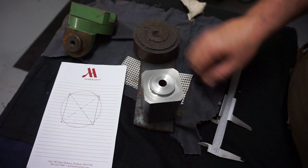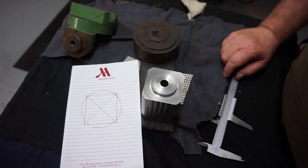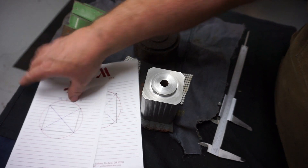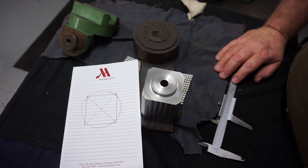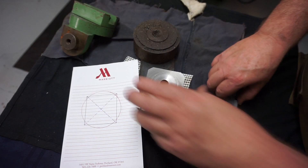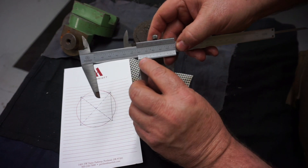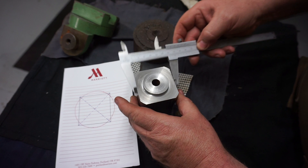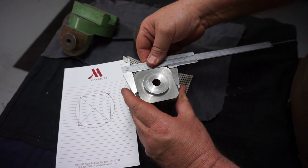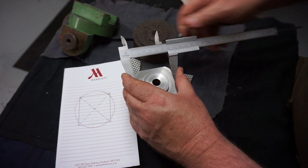I've just finished up the block in the milling machine and I'm quite happy with it. I had to redo my drawing — I'd actually stuffed up. This drawing was out; I'd accidentally done 50 mil here instead of 60. So this is the more correct representation. I'm shooting for 60 millimeters for the outside. We'll throw the old Mitutoyo calipers on and have a look. I'm quite happy with that — it's that side and that side as well. I think I'll open them up a little bit.